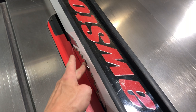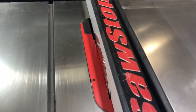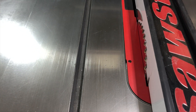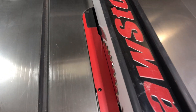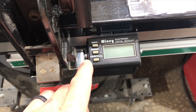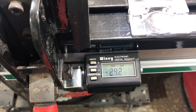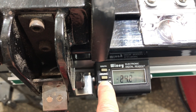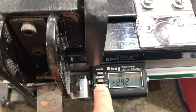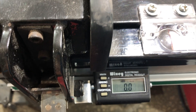The last part is to raise your saw blade up until the blade is just barely scraping the fence, because when you turn it on there's a little bit of flex in the blade — that flex will disappear and you will be right where you need to be. We're going to go ahead and turn this on. It takes two AAA batteries. So to set our absolute zero, I want it on ABS, and I'm going to hold down the on button and then hit it again. Now our absolute zero is set.